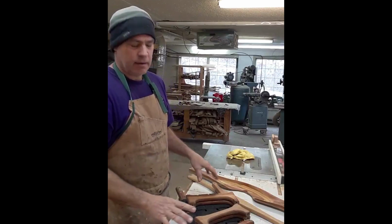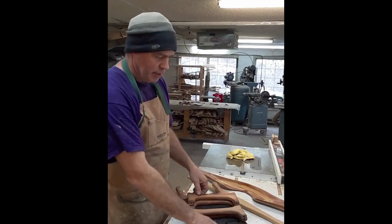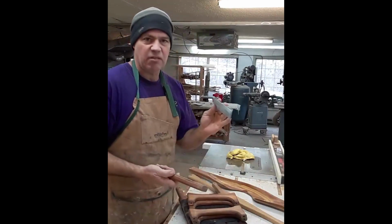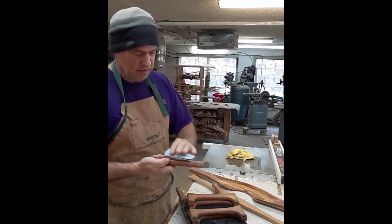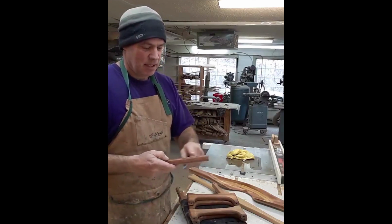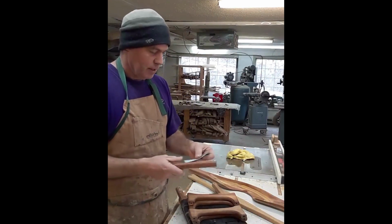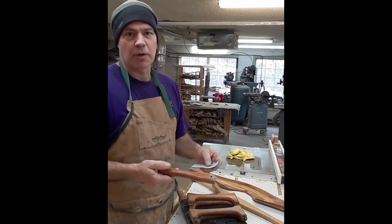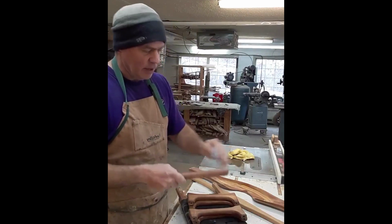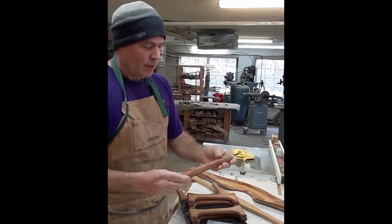Meanwhile, I've got the yoke and thwart and seats and all the seat trusses and grab handles out here. I'm going to give them the same kind of treatment. I'm going to go over them with 120 grit. They're not in too bad condition. If they were really rough and gray, then yeah, I'd want to start with the 60, and get that all off, and then work up through my successive grits of paper up to 320 again. But I'm going to start with 120 because they're not in too bad condition, and then I'll go to 220, 320, and give them a coat of oil as well.